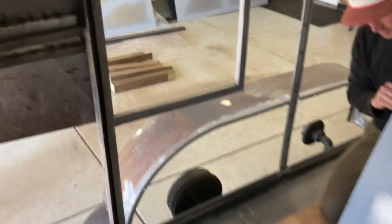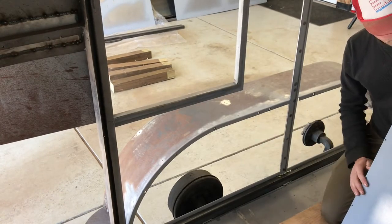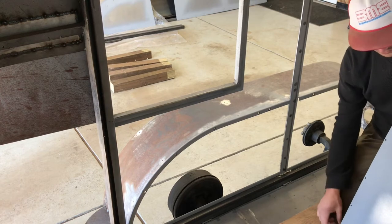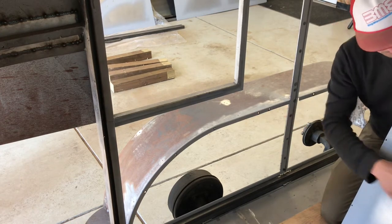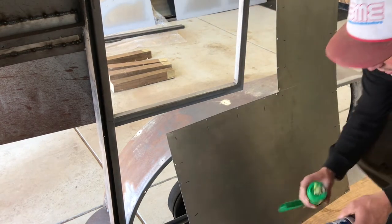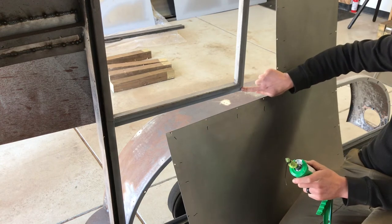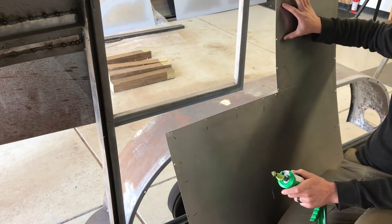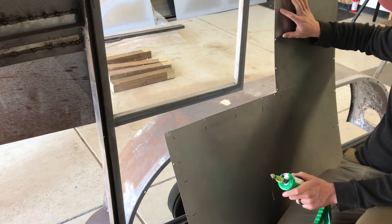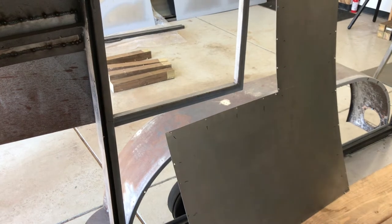Frame is primed. Got this primed for where it's gonna be behind the fender, all that stuff. Got our spot welds punched out. Got where our spot welds are on the fender. So we're gonna take our seam sealer, all seam seal, tied on these edges away from the spot welds. So it'll probably be, you know, 3/4 inch away from the spot weld. Utilize these magnets.